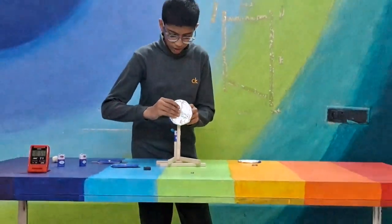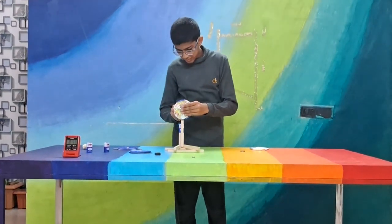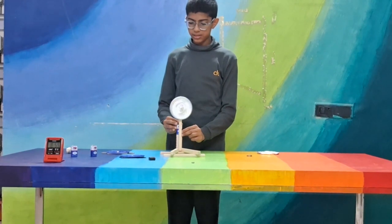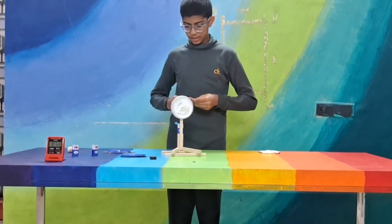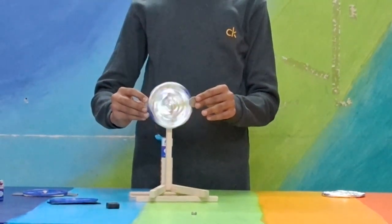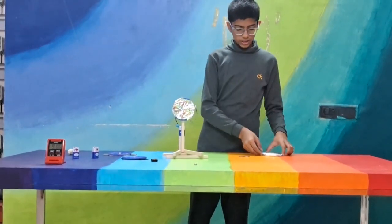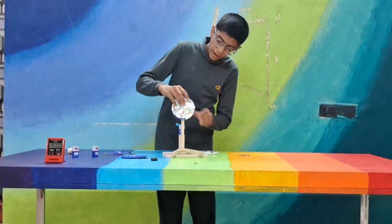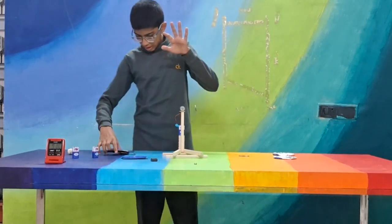You may not have noticed that it has two aluminum brackets. Let's try it out. We will accelerate this, and then we will apply the magnets. Did you see that? It took more time, because there is less surface area — one of the conductors is less — so it passes less current. But still, the velocity is slowed down.